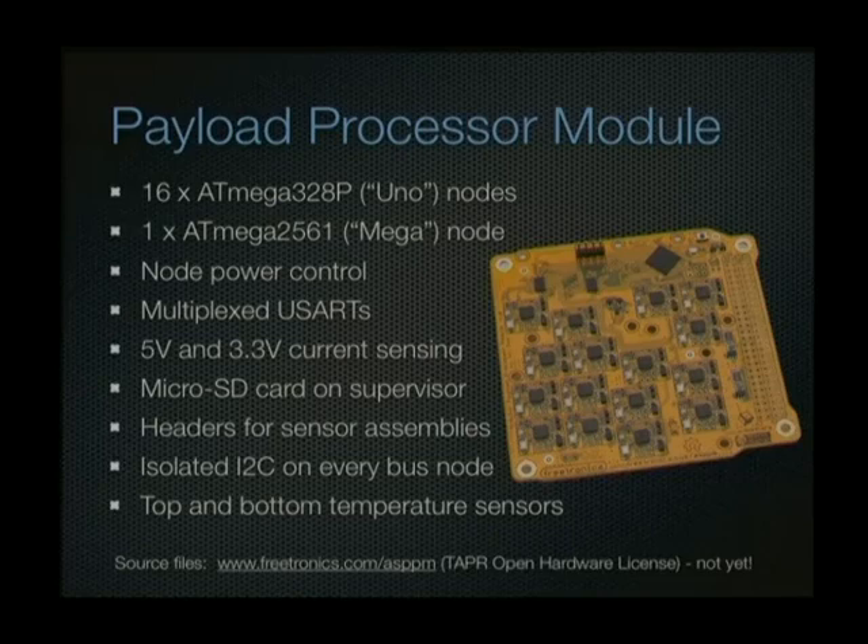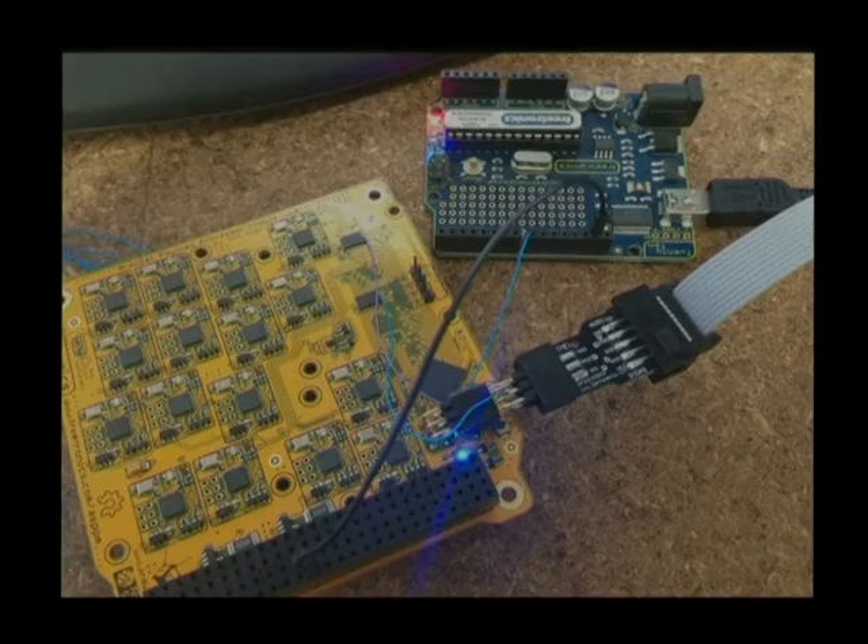There's a question from the audience: with a lot of AVRs on board which aren't considered low power, what's the power budget for this board? It's in the order of a couple of hundred milliamps. There are also some mistakes I made — several bits of shame in this photo. One mistake was that the ICSP connections for this particular MCU package are not on the SPI connections like the rest of the family, so I routed the wrong connections and couldn't load firmware. Luckily the correct pins were taken out to the MUXes with handy 0.5mm pitch pads, so all I had to do was break out the microscope and it was easily fixed.